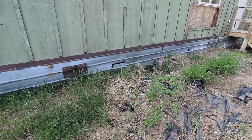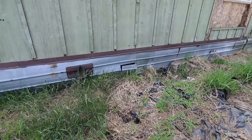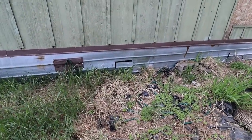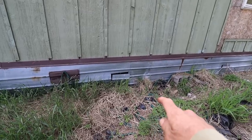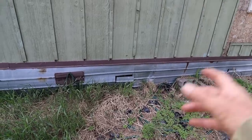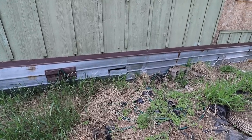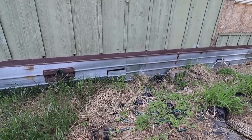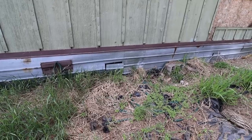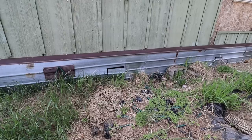The first thing I'll have to do is go underneath the mobile home here. I go inside and I have part of the floor cut up where I can pull it up and get down to where the water stubs up from underground. I've got that all insulated and heat taped — I just shut the heat tape off two days ago. That heat tape goes all the way underground because the water for this comes straight from the actual well and doesn't even go into the house.